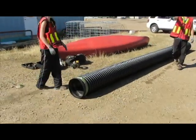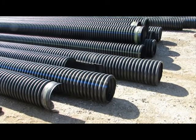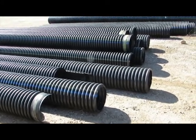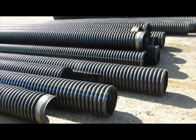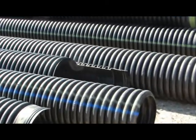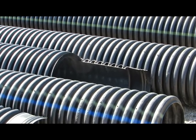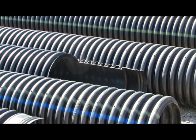You can see on the pipes that are finished we have this notch cut out of the end of the double wall pipe. That's the part that's going to be inside the cage, and we cut that notch in it just to help the water flow in more smoothly so it won't make such a whirlpool and suction, be noisy, or be something the beaver is going to feel.